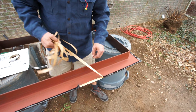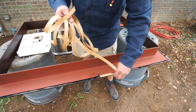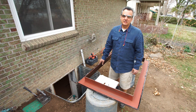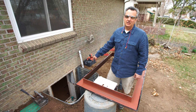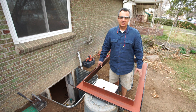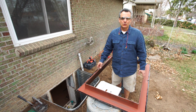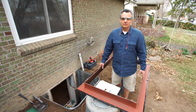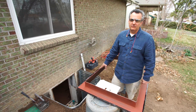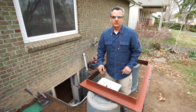You can now see how this is just a continuous seal and how well it's going to seal against the wall. We're going to reposition the ExoFrame so my helper can bring it down to me in the hole. When we stand it up vertically, we want to stand it on concrete or two-by-fours so that you don't get grass, leaves, and debris on the butyl.